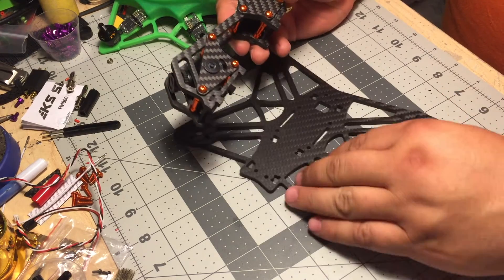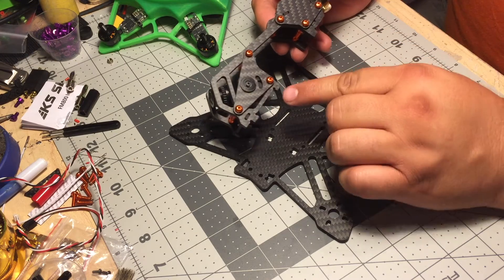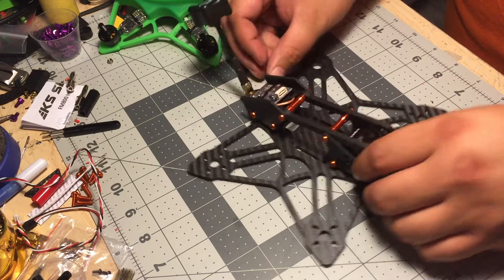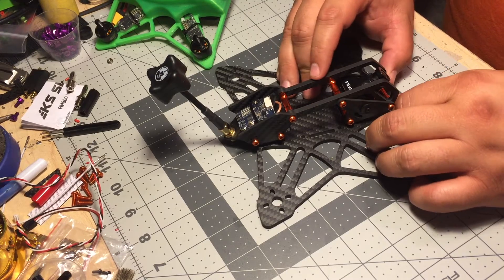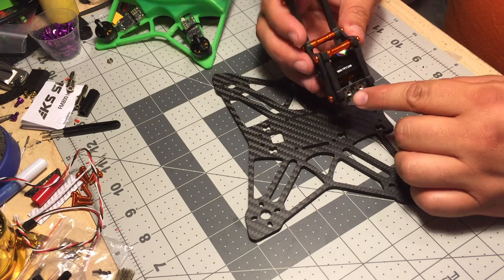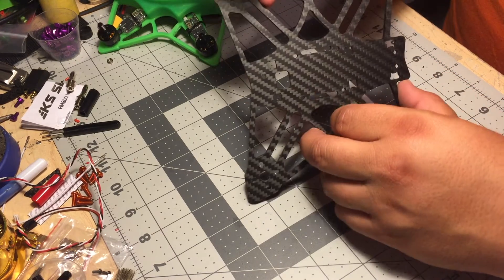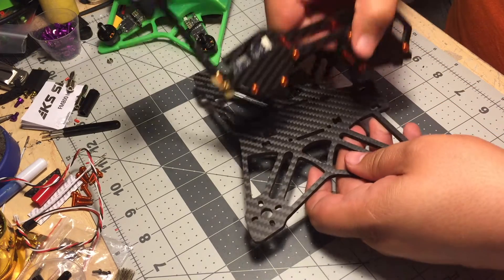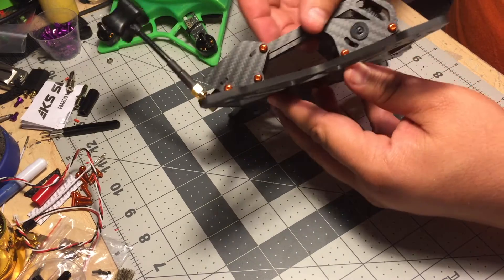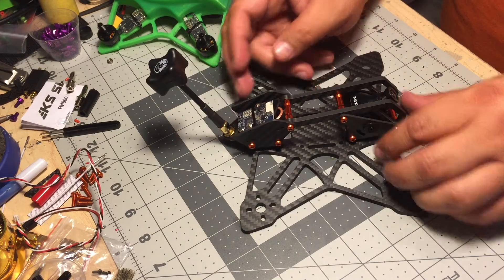The way the pod attaches to the base plate is pretty simple. The 4-millimeter roll bars have tabs on the bottom — three tabs on each, six total — and the tabs drop into matching ports in the carbon, which locks and locates everything. If you have an impact, those tabs spread the force through the frame. Then there are two smaller 2-millimeter plates with pressed-in PEM nuts and matching holes in the bottom plate, and once you put screws through those, they hold the pod down under tension.